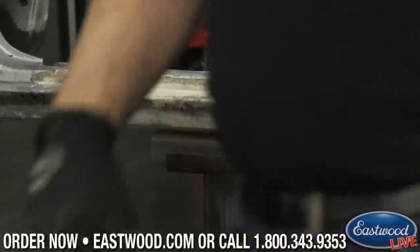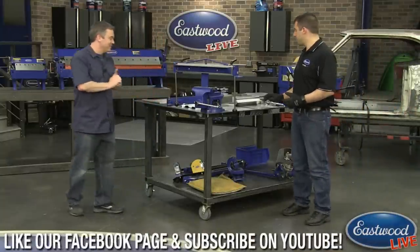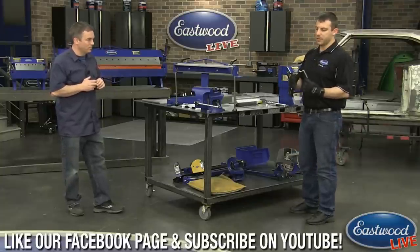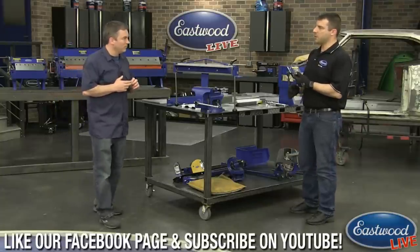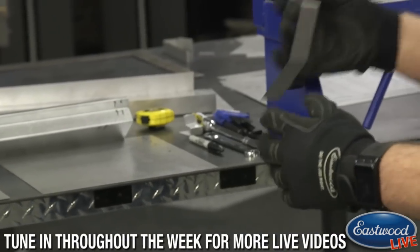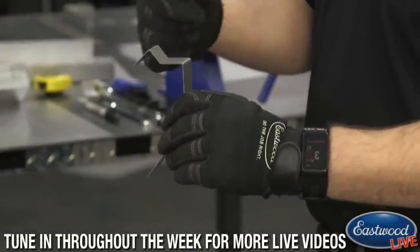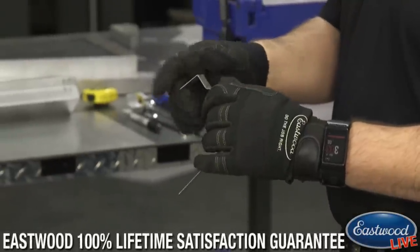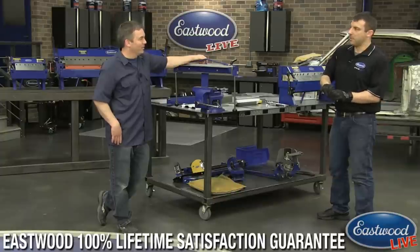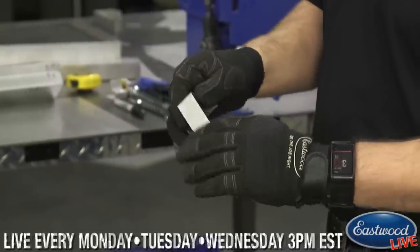What I would suggest if you're a first timer when it comes to using these — grab a small piece of sheet metal, start maybe one inch wide, and start making your bends. You can keep going back to the vehicle over and over again and tweak — a little bit five more degrees, ten more degrees here. Make sure you're bending it in the right direction; if you mess up you can bend it back, though you can see it gets a little bit of a crease — but it's just a template.